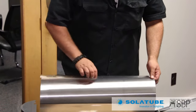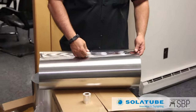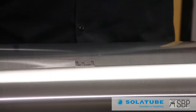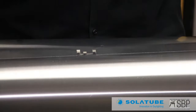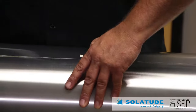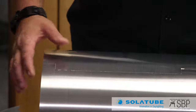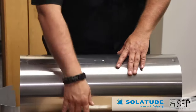I'm going to take these extension tubes and just take the center piece. You've got notches to make this a tapered tube — like we did earlier on the SoloMaster. I'm going to set it into the shallow notch to make it a wider opening, weave it through the center portion, and take that bottom piece and put it into the deep notch to make it a smaller opening. So I've got large opening on top, small opening on the bottom — that's my tapered tube.